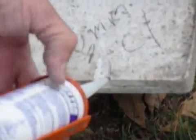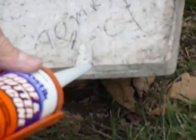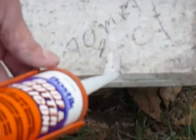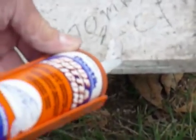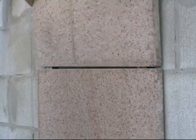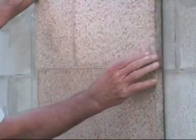It is best practice when installing StoneClip to secure the panels at top dead center through their fixing point and have a 2 millimeter clearance under the shaft, so the weight that is being transmitted downward is not going to impact on the top of the panel below and will only be carrying its own weight. This is the true meaning of mechanical fixing.